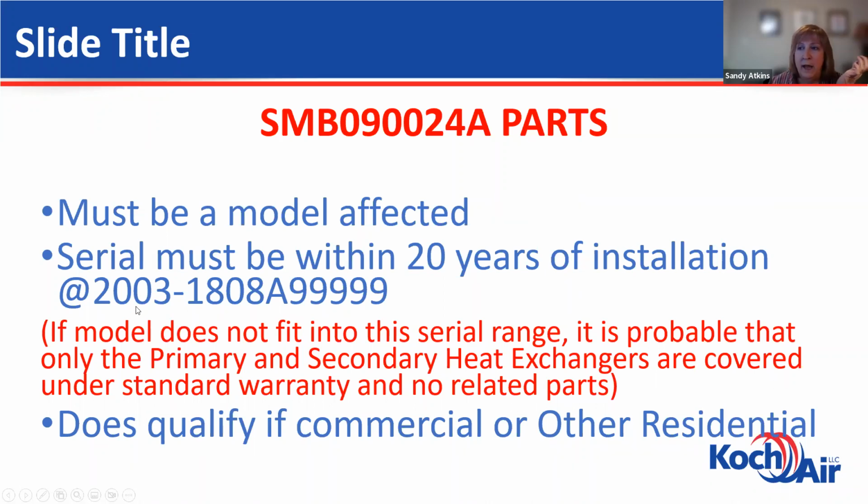So as of January 1, we're getting into the 2003 models. So within 20 years of installation, if the model does not fit into the serial range, the unit probably still has primary and secondary heat exchanger coverage. It could have, but no related parts will be covered. The only reason the coupling box kit, the inlet and outlet panels are covered is because they fall under this bulletin, SMB 090024A. A commercial unit or other residential apartment, those do qualify for this. They can be changed out.